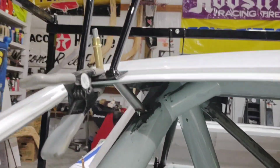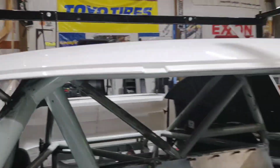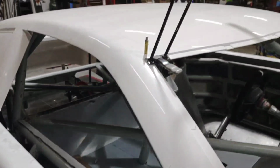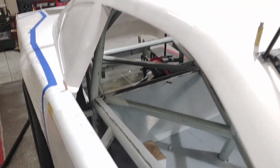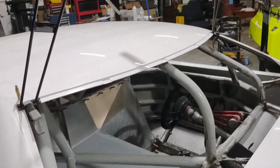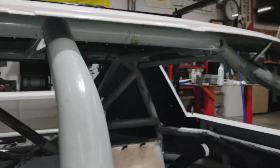This just ensures that that spot stays locked down and doesn't move. And I mean, if I was to do all 4 of them and then go through and weld them, it may move, you know, a 16th or an 1/8 and throw it out of whack. This just, like I say, keeps the consistency, makes sure nothing moves.